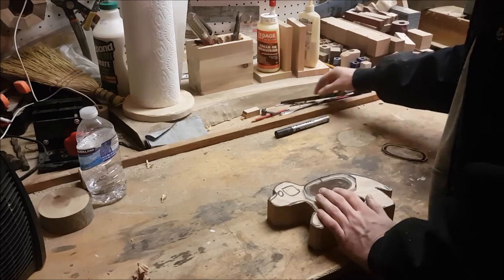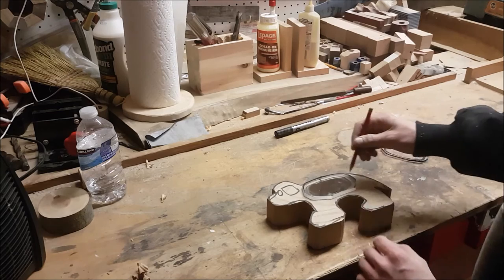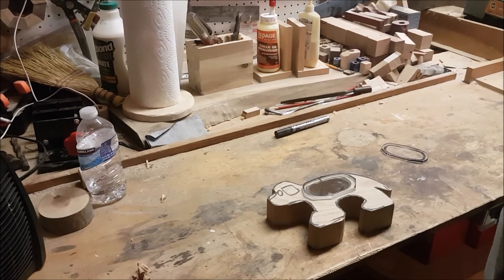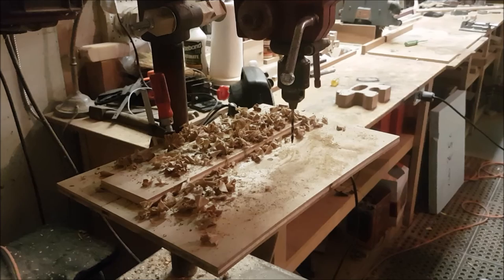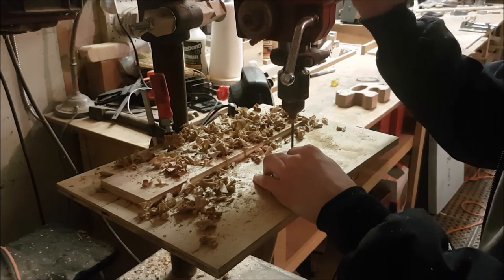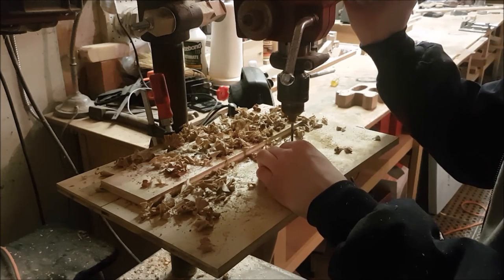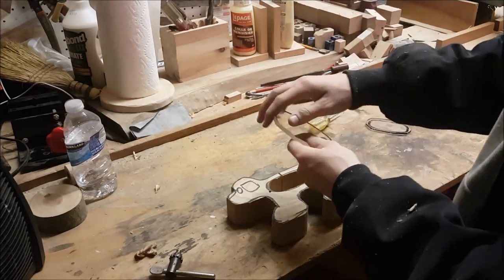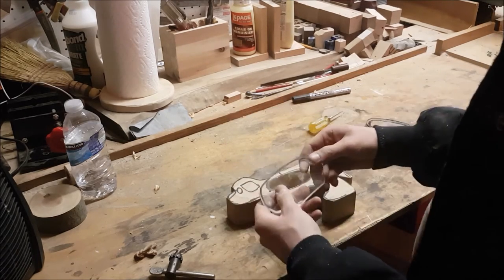Basically you're going to want to map out where you want to drill holes — you do that with the marker on the plexi, and then drill the holes the right size for the screws you have. Once you've marked the points, go ahead and drill right through. Once you have that done and the edges filed or sanded and the holes drilled, it's basically just putting it together.